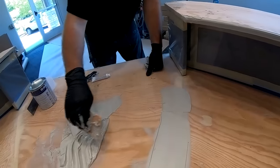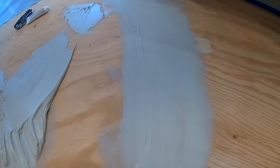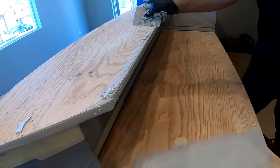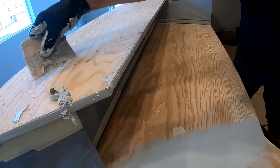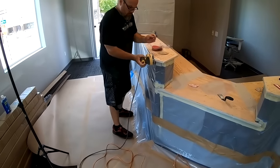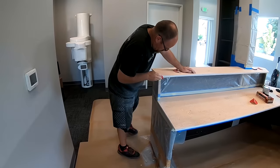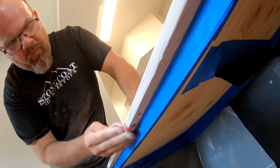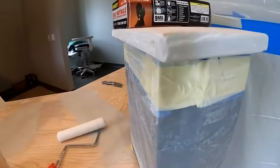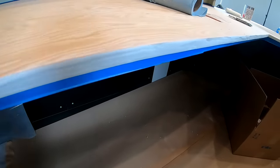It's literally finger painting at the next level. The seams in the plywood had been glued together, but I'm going to apply a top coat of Bondo so that I have a nice smooth transition between pieces of plywood. As the Bondo starts to harden but before it's all the way hard, I'll use my Bondo spreader to scrape off any excess. After it's set up, I'll use sandpaper to smooth out any sharp points, then turn my sander on low speed with 220 grit and smooth that out. My goal is to make it smooth to the hand. I love the look of that natural edge — it really brings Stone Coat countertops to life.